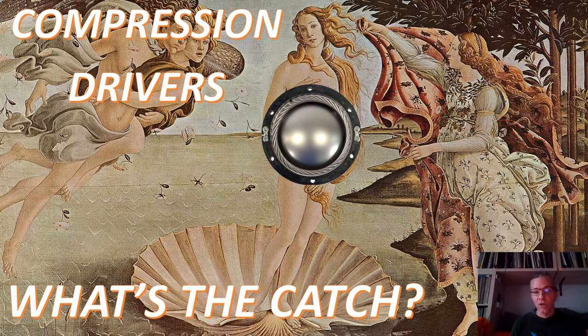But if you want to look at the distortion, how much they color the sound, the compression drivers win hands down. So if you want a natural sound, then compression drivers are perfect for you, if your main criteria is mid-range through mid-high frequencies. If you want that 17 kHz plus region, that just adds some bare ambience to the sound, which is beyond anyone's hearing acuity, then the beryllium tweeters are better in that. However, that is like icing on the cake.